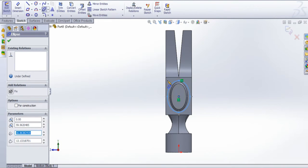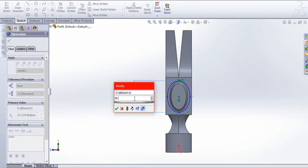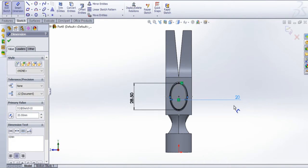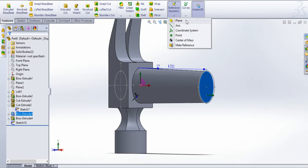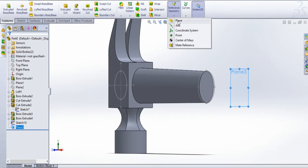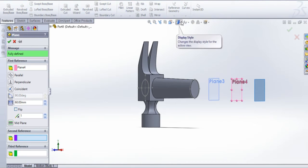Draw like this. I'm going to give a dimension for this from vertically this point to this point is 28.5 mm, and this point to this point I'm going to give is 20 mm, and then okay, exit sketch, select this part, reference geometry, plane. From here I'm going to give 50 mm. Okay, select this plane, again reference geometry. From this plane I'm going to give 60 mm. Okay, select. From this plane I'm going to give 40 mm. Done. We created the three planes,